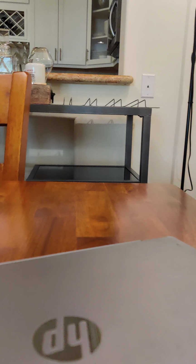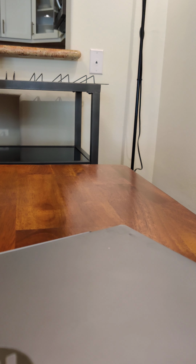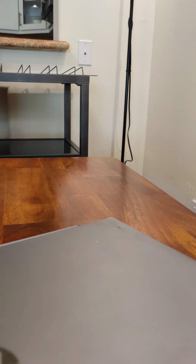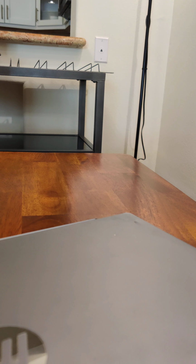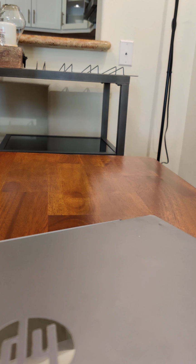On the outside, we have that one GFCI that wouldn't trip. The fire door, the door between the garage and the house, is missing the airtight seals. Does it need to go all the way around, or is it just the bottom? The whole door. There is a cover missing on a junction box up in the attic.